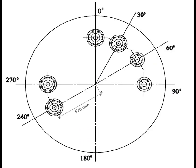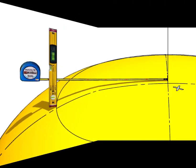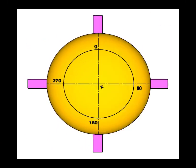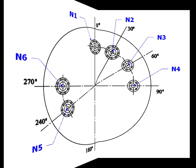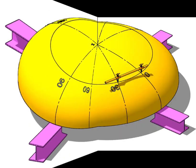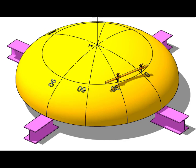Check the radius of the nozzle center. Don't mark the given radius slant on the dish end. Hold a level bottle vertically and then mark the given distance straight, as shown. The nozzle radius may vary according to the location of the nozzles. Here I am showing a single radius for the purpose of example only. Let us mark the centers of nozzles two and three. Divide the zero to 90 degree quarter into three equal parts — you will have three sections of 30 degrees.